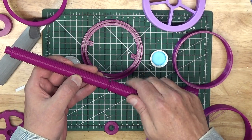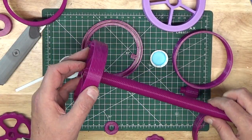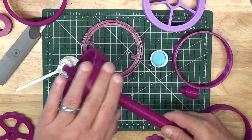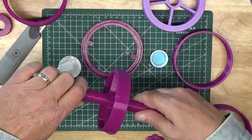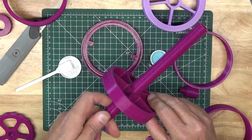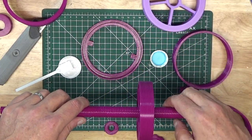This part has been designed so that when tightened, the threads naturally line up so that you end up with a continuous thread, even at the joint. But before you let the glue set, use the spoke part and check that it travels freely over that section where the two parts of the screw connect together.